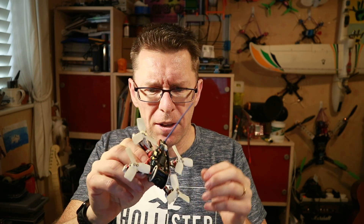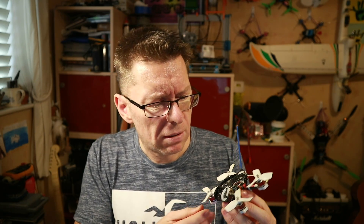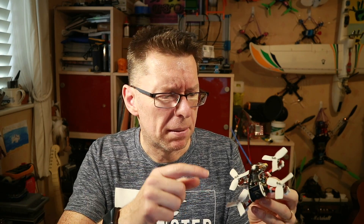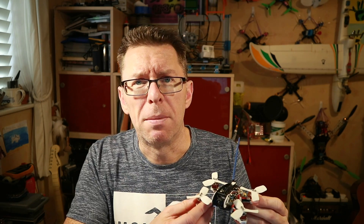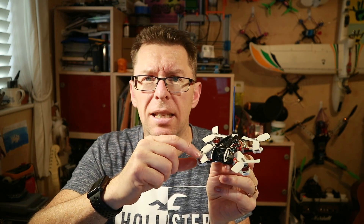That was a short and not particularly sweet experience — the quad was absolutely covered in grass. I feel like I can't finish the review here because it hasn't had a fair go — some of it my fault, some of it its fault. I'm going to have to come back and do a part two and correct a few things. I'm going to swap out the XM with an XM Plus and give up completely on XMs. Maybe I've just got a tough one. Two experiences now, both around 100 meters when it just fails — and if you're lower to the ground you haven't got much chance of recovery.